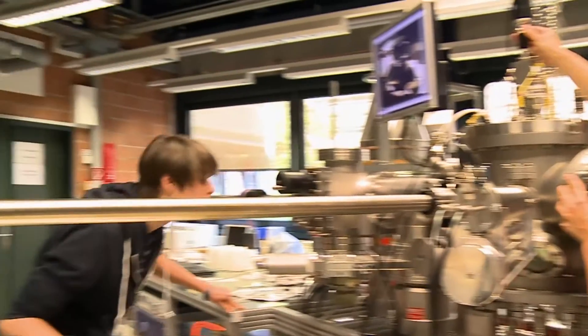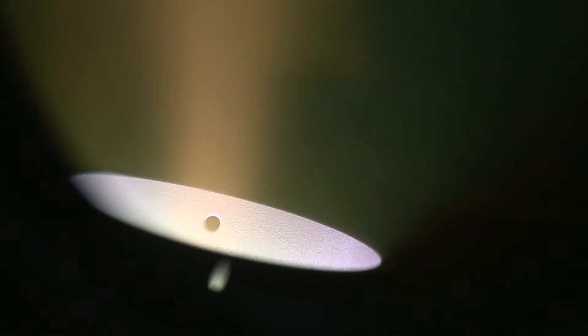What we combine is the function of thermochromic behaviour and optical selectivity. A good solar absorber coating should absorb the solar radiation in the wavelength range between 250 nm to 2500 nm. Fortunately the infrared radiation is not in the same spectral range — this is around 8 micron — so the solar collector surface would radiate in the mid-infrared range.